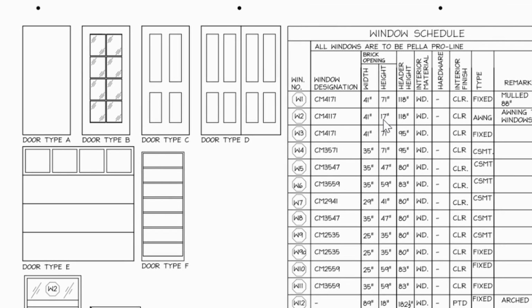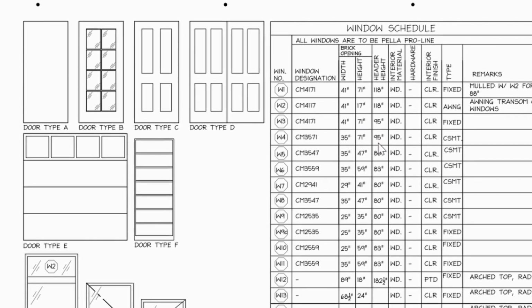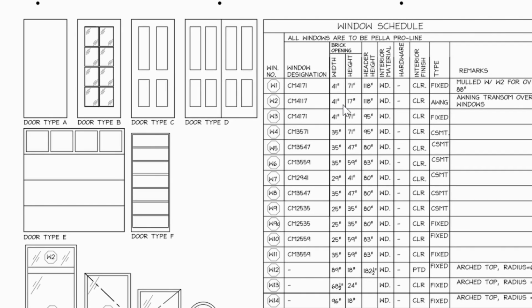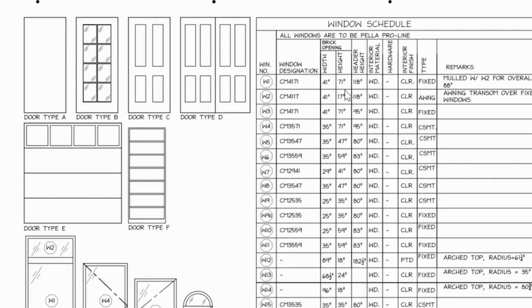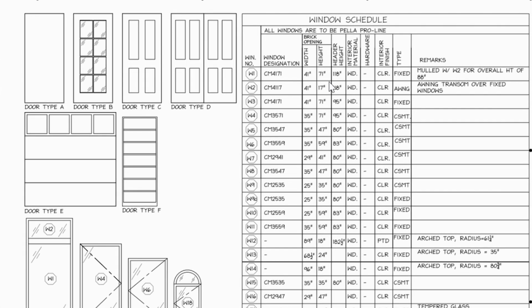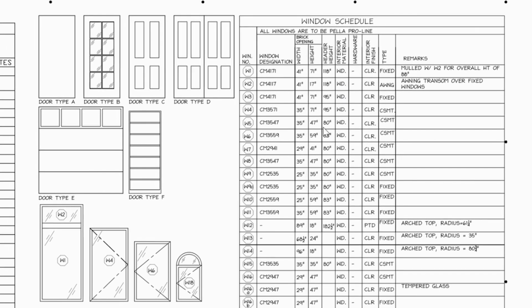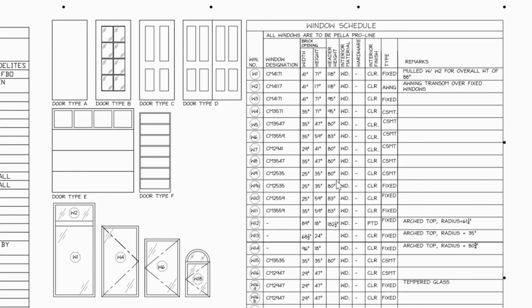and it gives the dimensions. And of course, you're supposed to frame the windows a little bit, 3/4 of an inch taller and wider so you can fit them in without any troubles. I went and tucked them in real tight. I made them 1/4 inch wider in some cases. In some cases, I went, I'm gonna squeeze this in. I'm gonna just trim it a little bit, and it'll be perfect. But anyway, you'll see there's a reason that they tell you to do that extra 1.5 inches.